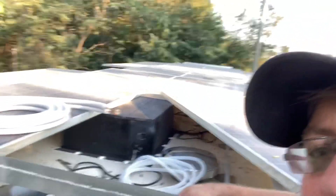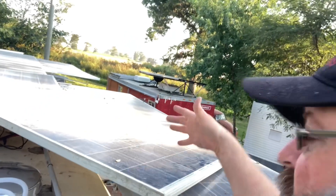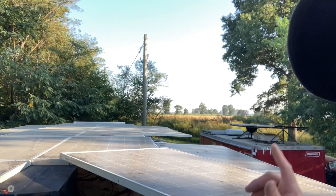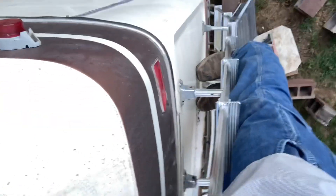Once I get done with this, maybe I'll wash off them nasty panels. We've got 4,200 watts there, and if you can see over there, we've got a bunch more on tilt — they're supposed to follow the sun. But where we're at, we're surrounded by trees, and our best light is between 10 o'clock and 1 o'clock because of all these trees. So I don't have them moving — not much sense in them moving around. And then we've got the deployable down there, and that's 865 watts I believe.